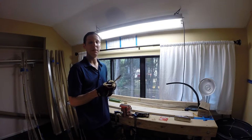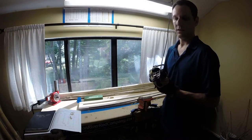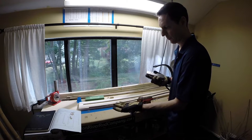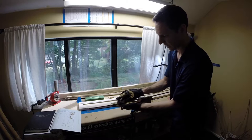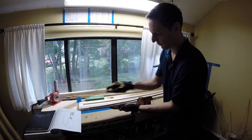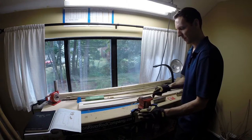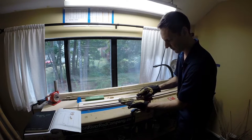So that I have meat on the bone still to keep working in future steps. The key here is sharp plane blades. These are the strips that we split by hand in earlier episodes and started to straighten. I'm just going to hold the plane at a slight angle to get myself a 60-degree type triangle being formed, planing very lightly, just taking off high points — I've got myself a working area right there, and I'll go through this entire strip the same way.